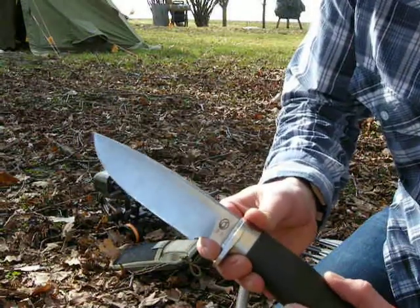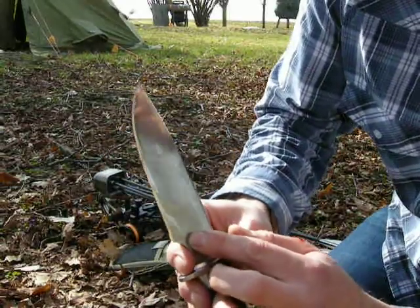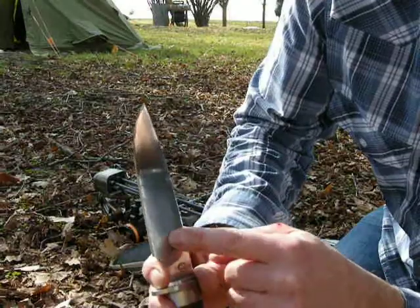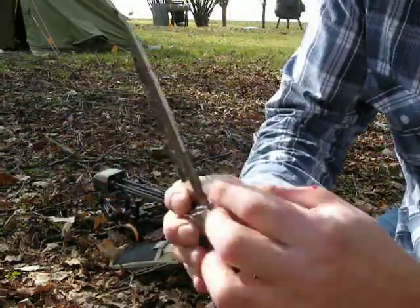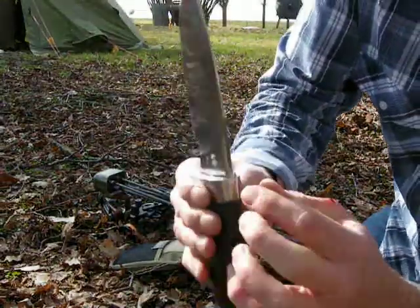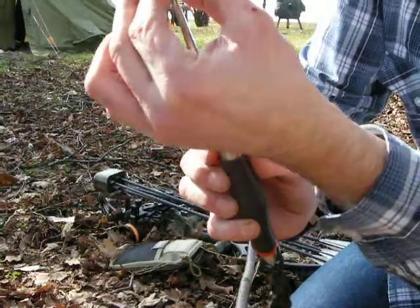His decision was to give me D2 steel, and he did selective hardening on this knife. There is a slightly fine hamon on it, but you couldn't see it in the video. This makes it ultra-stable because the 7mm spine of non-hardened steel makes it impossible to break. The 7mm tapers down at the beginning of the blade, and behind the choil we have 5mm, tapering down to zero at the tip.